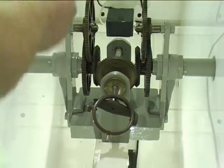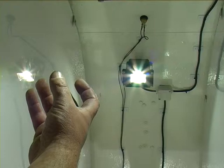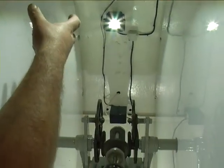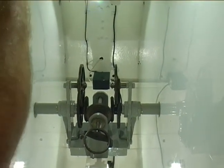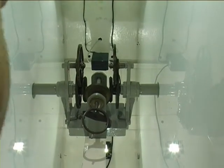With the Admiral, we're going to fit a bracketry up inside the top of the drum, which will be driven by a stepper motor and a programmer that will allow the figure to follow the sun in the course of 24 hours, and do its pirouette on the hour, and then get back to its position that it should be for that hour.